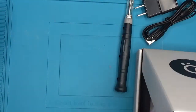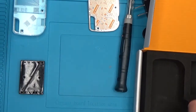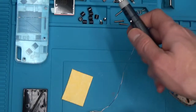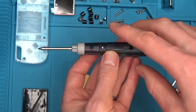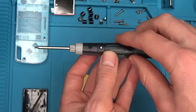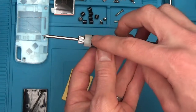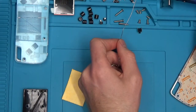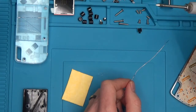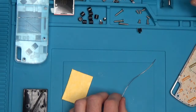Alright, let's set up our workspace. Let's have a look at that soldering iron. This soldering iron has a metal push button that turns it on and off. There are two different types of soldering irons — one is a touch sensor, and one is the metal push button like the one we have. The touch sensor one has a yellow strip along the top; ours is grey. Once you turn it on, it takes about five minutes to heat up. After it's heated up, tin the tip of the soldering iron by putting a little bit of solder on it. It should be shiny afterwards, and this allows the soldering iron to transfer heat outwards.